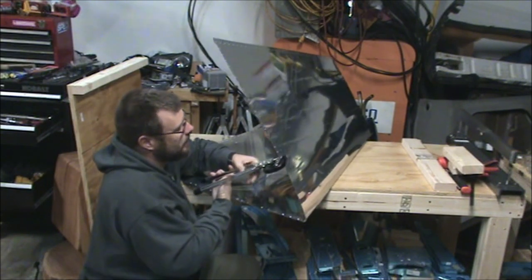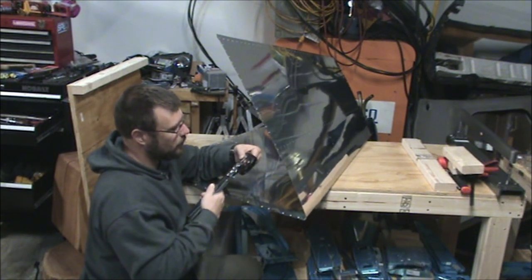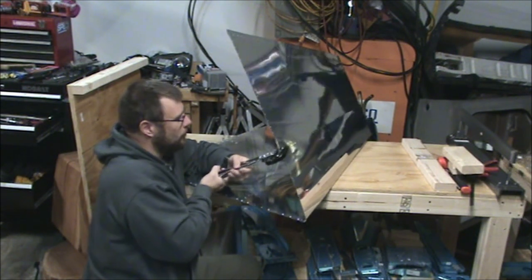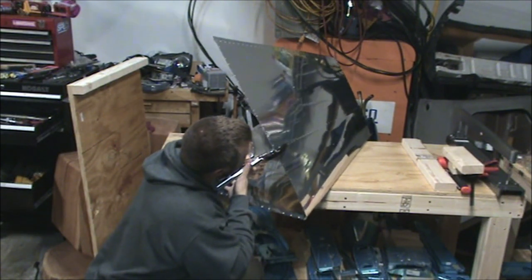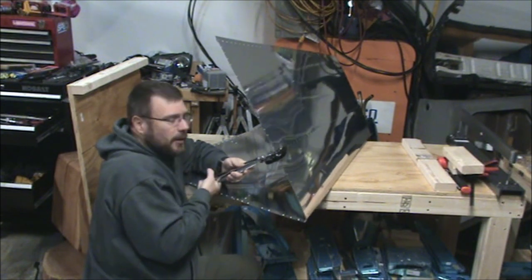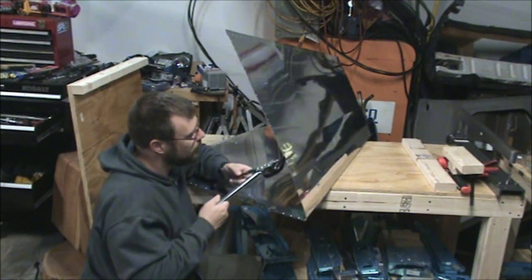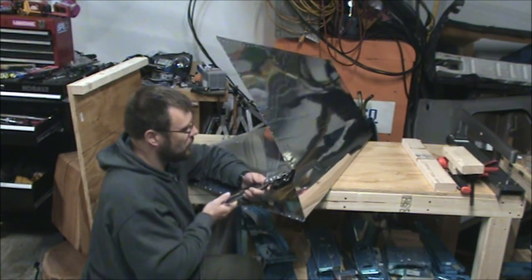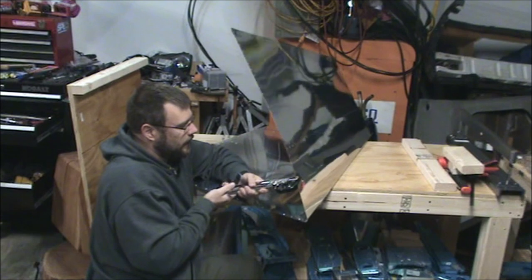And before you do that, you really ought to prime it. You don't have to prime, but I feel like the priming outweighs the additional time that you spend doing it and the additional weight that you add to the airframe. Hopefully I covered it in the priming video, at least I think I did. Basically, while I might not live near a coastal area where there's salt water, I do plan on flying this thing to the Bahamas. Otherwise, why bother building it? That's one of my favorite places to go diving. So it'll be in salt air during that time.